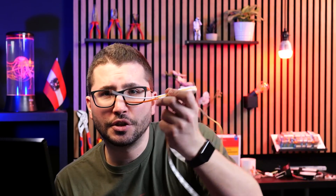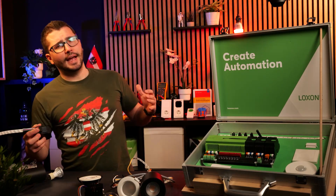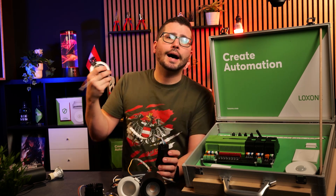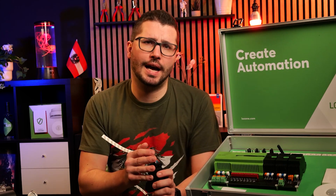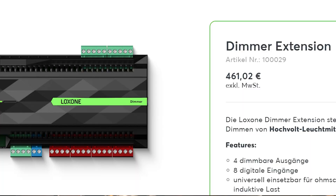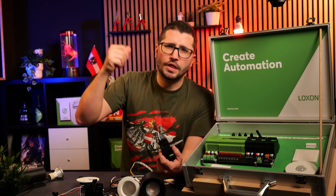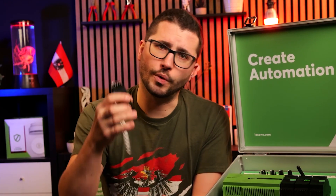I could just use some white color LED strips instead, also on one channel. You do need the power supply in the cabinet for those, and the lamps might be a little bit more expensive than the high voltage ones. But I really hate high voltage dimming. There is the Loxone dimmer extension with four channels — about 500 bucks. And then depending on the light you buy, you might end up with flickering, or at 30% dimming the light just turns off. So I go with 24 volt.